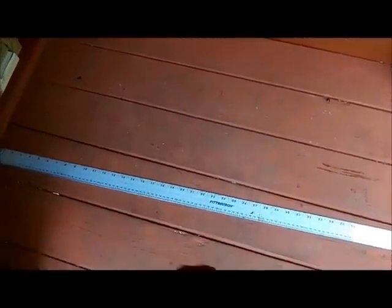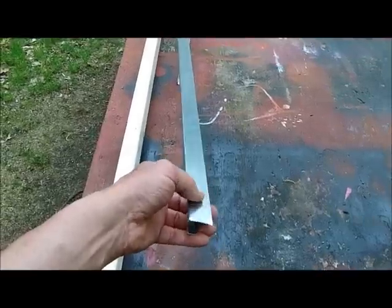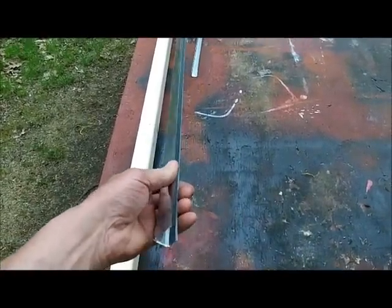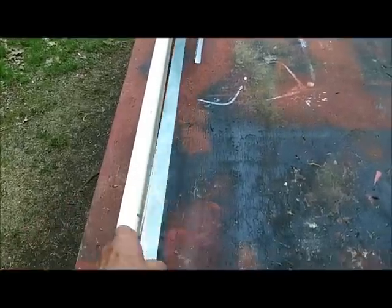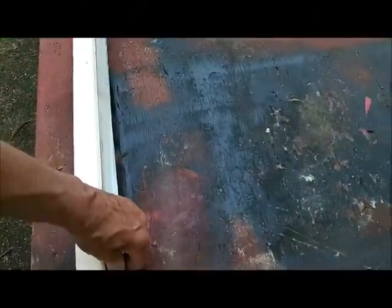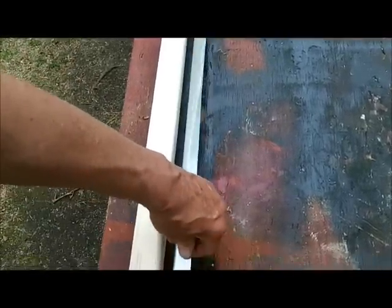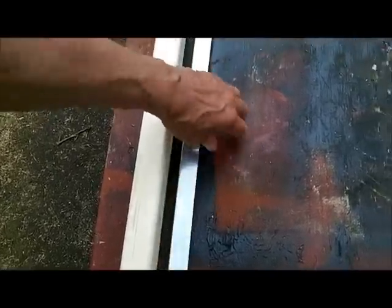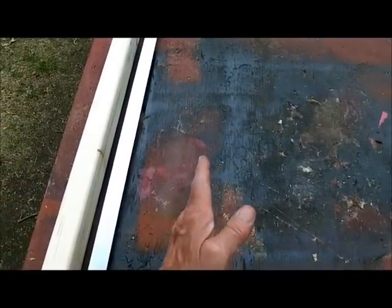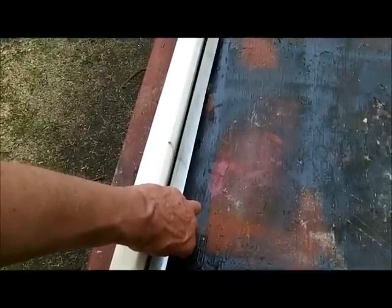The two by three will be a guide to keep it going straight. The plywood slide itself will have the metal strips on the edges — you know how the edge of plywood can separate and cause binding. When it comes up against the sides of the guides made from two by three, it'll be a smooth action. You want a little bit of side-to-side play — probably a good quarter inch on each side.